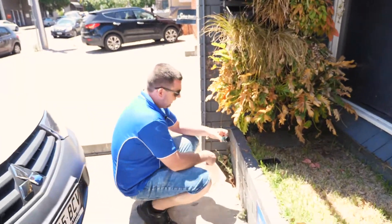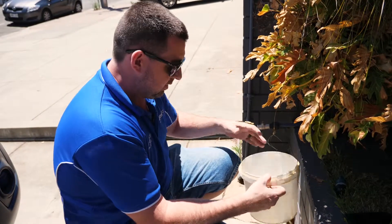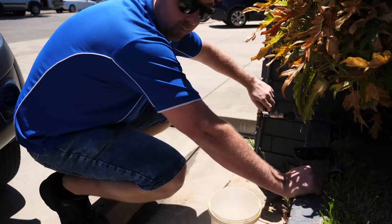Being this is only a five litre bucket we're going to get some spillover — it's not really a big deal, we just need it to be close to accurate. It's really important to make sure you remove anything that's on the tap, so don't measure your water flow through a garden hose or through a set of snap-on fittings. Turn the tap right on.